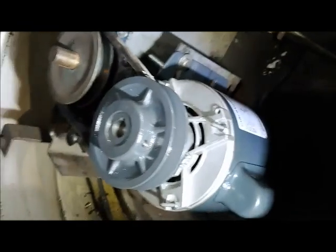When we come back for the HVAC on Monday, double check the superheat and subcooling on that walk-in freezer. We'll put an electrical whip on this guy too. But okay, so I got the new motor in, got the pulley, new belt in there, put a new piece of SO cord. I'm gonna run over to the J box there, still gonna hook that up.